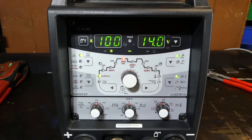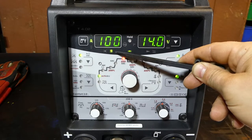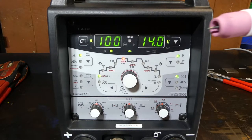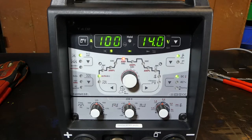We've got a few other features here. We've got the 'S' lit up, which is a safety feature showing that a safety variable is active. It's also showing that the VRD — the voltage reduction device — is active. What the VRD does is limit the amount of voltage available at the electrode, in our case the tungsten electrode, up until the point where you're ready to weld and then the machine gives it full power. That's to prevent anyone getting electrocuted — it's a safety feature. When that VRD light is on, that VRD is active.